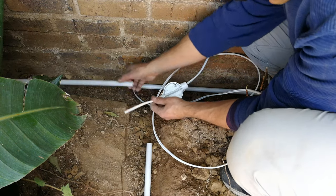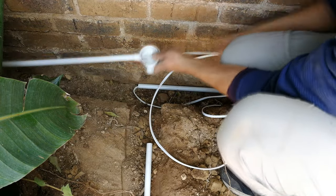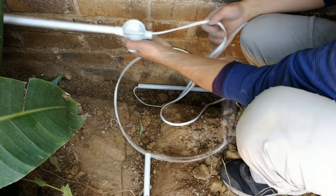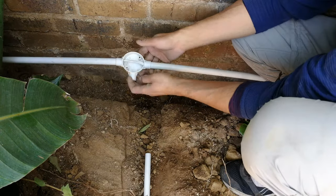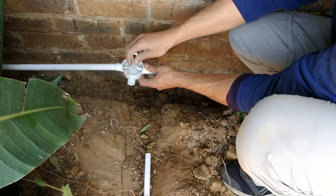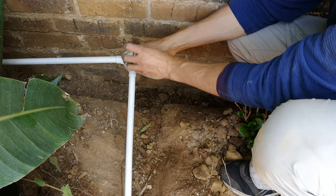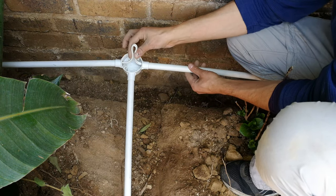But what you want to do is thread it, and I have the other trunk conduit. And then you don't want this so tight. So what you're going to do is pull it back a bit and do that. So that's enough to make a join because we are going to join that way. So what we'll end up doing is that will go in there and I'll run a cable from there to here and I will put a three-way join here, a terminal block, or you can crimp it. But remember to do that, otherwise you'll have too little cable.